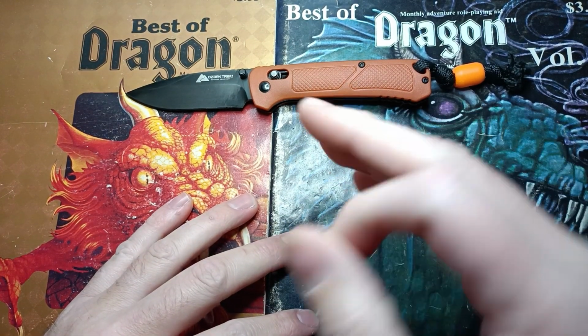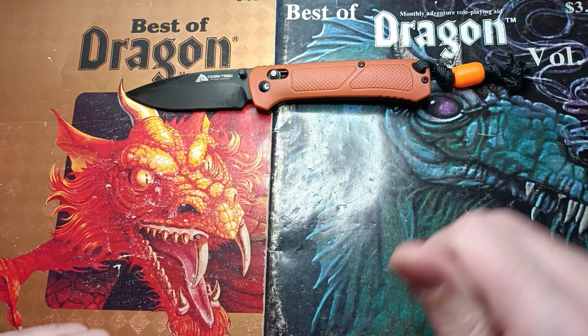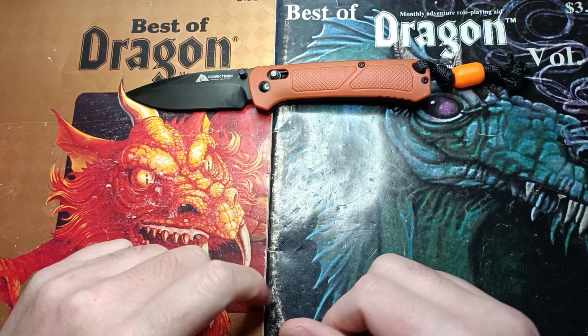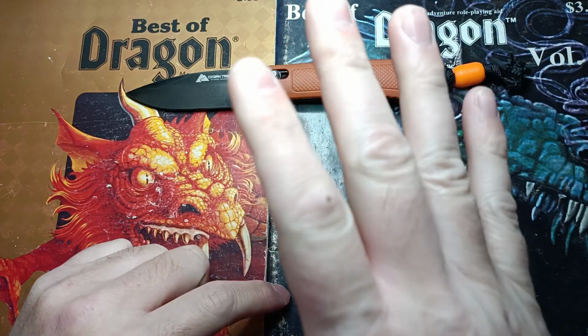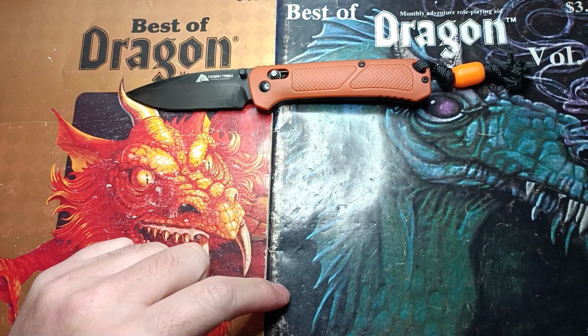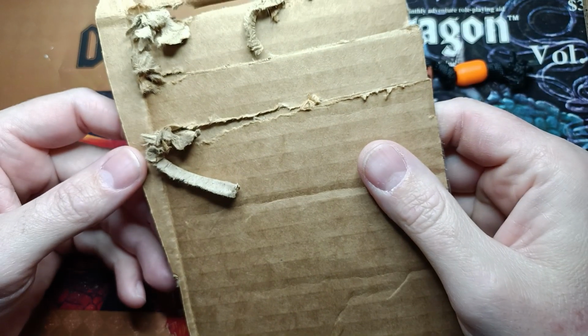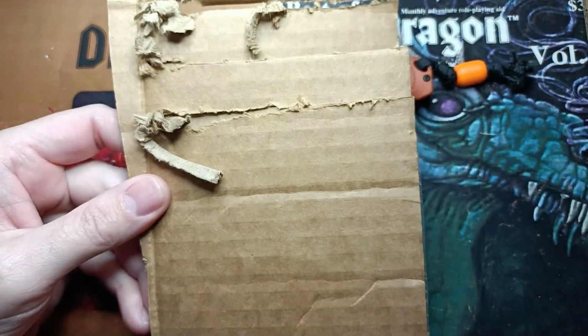At the 2-hour mark, it was pushing 537 in the worst spot, still cutting the copy paper, still not tearing and rolling the cardboard yet. At 3 hours, it hit 622, which is right there at the edge of completely devastated territory. And at 3 hours and 15 minutes, we started getting this. We started cutting with the grain. And I will say, when you're cutting with the grain, this happens a bit easier than cutting against the grain.